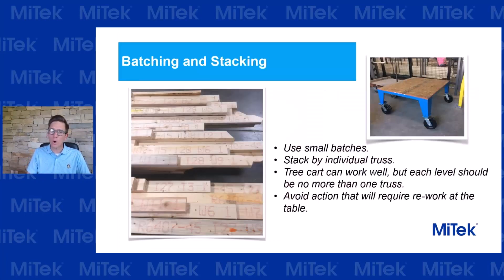Another item that is often overlooked is what a batch looks like, how big a batch is, and how those batches are delivered to the tables. I really promote using small batches — something in the four to maybe six truss size at the absolute max. When you do that, it allows the pieces to be stacked on the cart in a way that's easier to handle, and easier to stack so the builders at the tables can utilize them. By that I mean stacking top cords first, bottom cords second, and webs third. It also allows you to ensure the boards are oriented so they don't have to be spun around or turned at the table — we're doing that to maximize safety as much as possible.